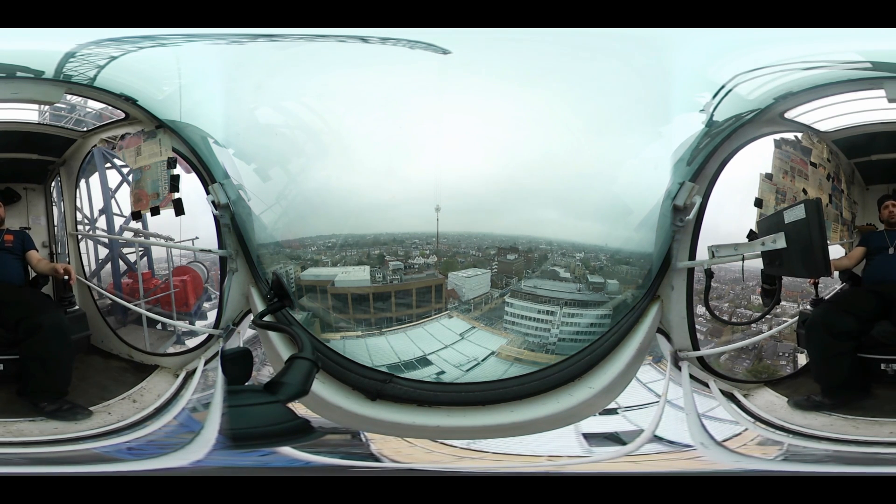That's how you cut the slew - you get on top of it. Because if you carry on going, it's moving in waves, always going like that following the top. What you want to do to stop that is to be on top of it, spot on. If it's going in and out as well, then you have to follow it in and out on the jib or the trolley depending on your crane. On the slew left and right, you normally go at 60 to 50 percent - depends on the speed on your crane.